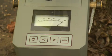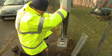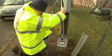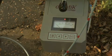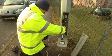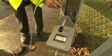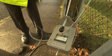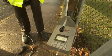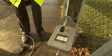We're now ready to test this column. Move the probe down the middle of the column and watch for a reduction on the meter — this would reveal a loss of wall thickness. If there's room, a more thorough test would result from moving the tip down the wall of each of the four quadrants. Steadily move the probe down checking the meter. A drop to about zero will be observed as the probe passes the cable entry hole, and then an increase back to 100% when the hole is passed.